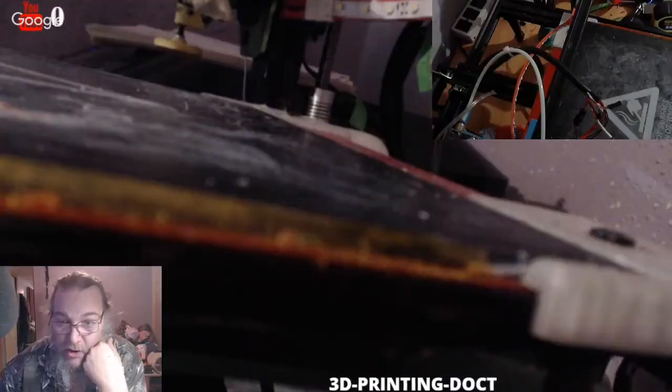Yeah. All I've ever gotten out of that thing was string. I've brought the retraction up to like 10 millimeters, and no matter what, I've always gotten string. Started using Idea Maker, and I brought my retraction all the way down to 2 millimeters. Nice. Which is wicked short, I mean, that's an 1100 millimeter Bowden tube. To only have to do a 2 millimeter retraction to get a good clean print is just unheard of. And I don't know what it's doing different.